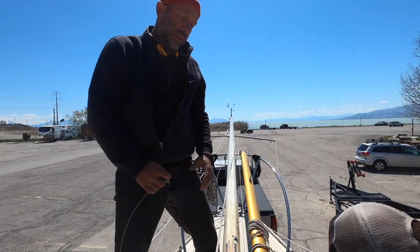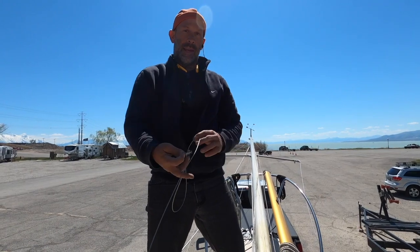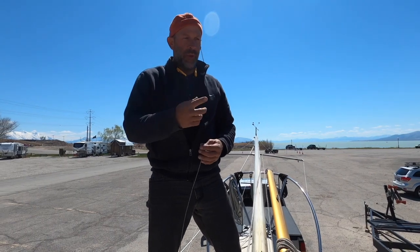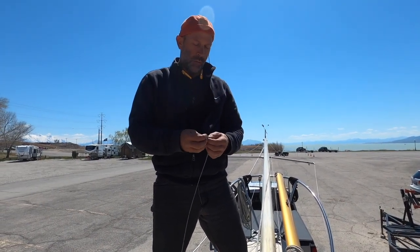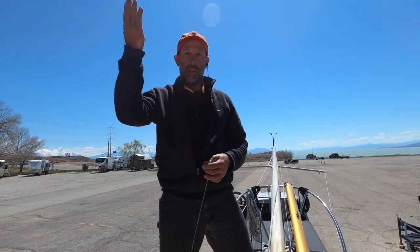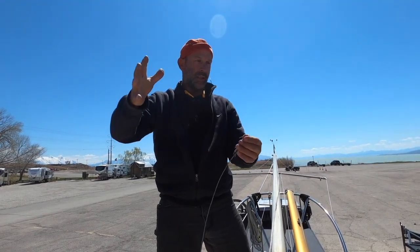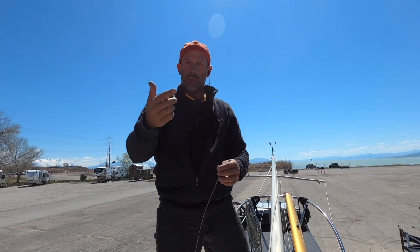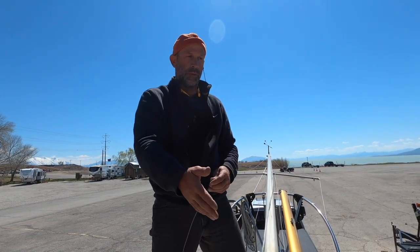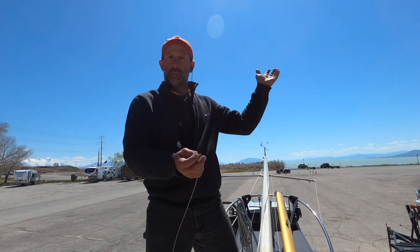Once you set this whole system up for your boat, it doesn't have to be adjustable. Then you just hook all these things up. You can even make some marks on stuff to make it so it all goes together the way you want. This is a much easier system to rig and mark and set when the rig is up, because then you can hook it up, get it all tight, tension just how you want it, tie knots, make marks, put tape on, whatever you want, and then you know. Even on your halyard and your topping lift adjustments, you'd have a piece of tape around where you would tie those off. And then you just hook it all up, put it in place, and away you go.